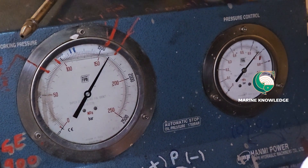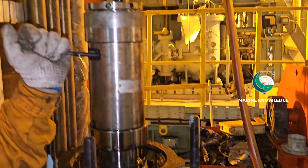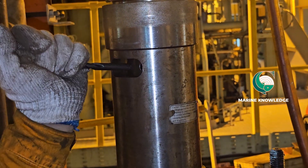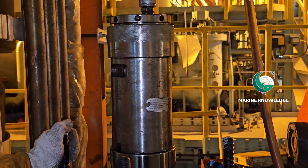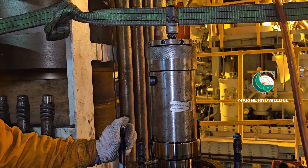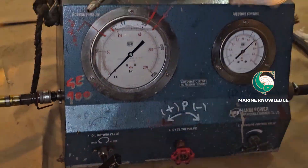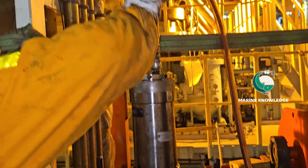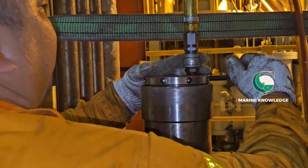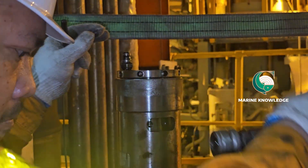This is the opening pressure for this kind of hydraulic nut. You can see it has already opened — just open it about 5 to 6 turns and keep it ready. While releasing the pressure, check it is not getting stuck. Once the pressure is released, remove the hydraulic high pressure hose, then remove the hydraulic nut and spacer completely.